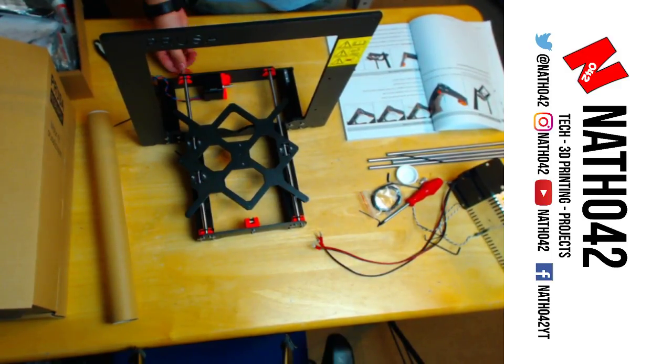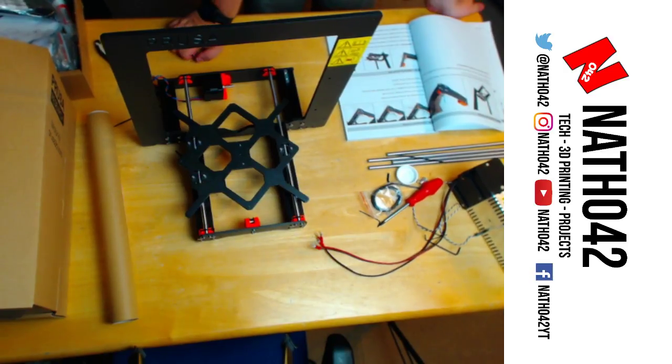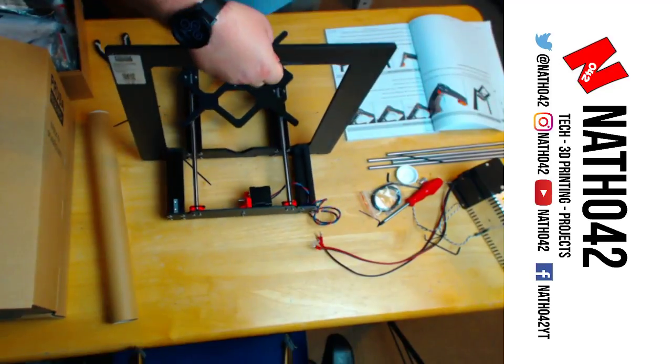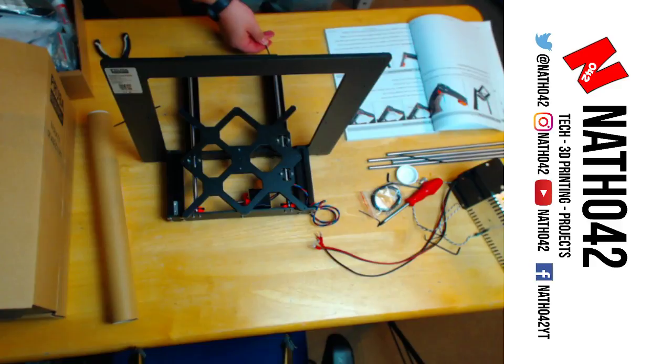The thing was, I feel like it was fairly perfect the way it was. I feel bad for undoing them now. Oh dear. Proper alignment of the smooth rods is crucial to reduce noise and overall friction. Ensure all M3 10 screws are released so the printed parts are able to move. Move the carriage back and forth across the entire length to align them. Then move the carriage to the front plate and tighten all screws in the front. Move it to the back plate and tighten all screws in the back. Okay, that's cool. I can do that. That is not that difficult.